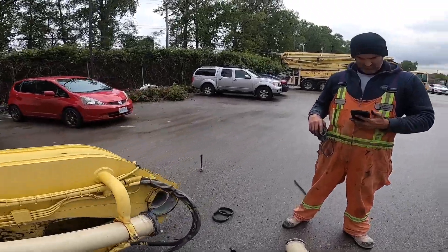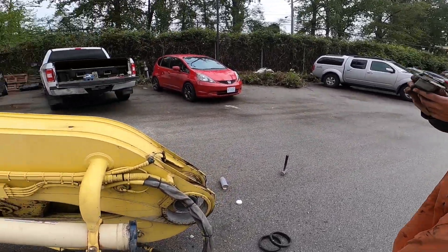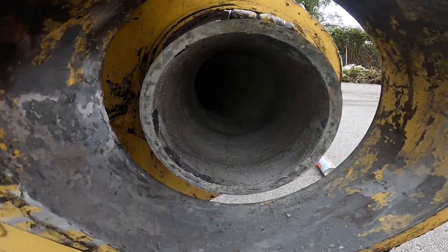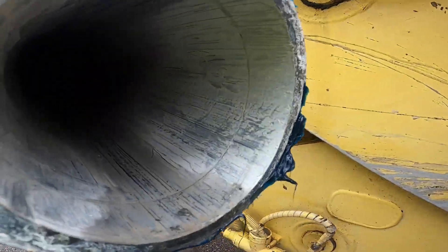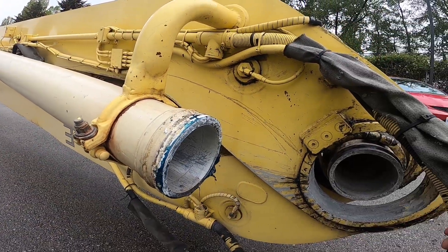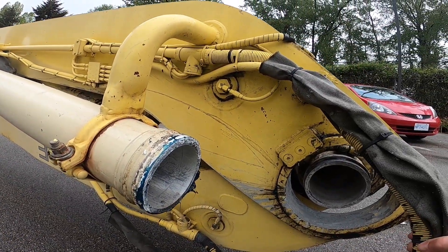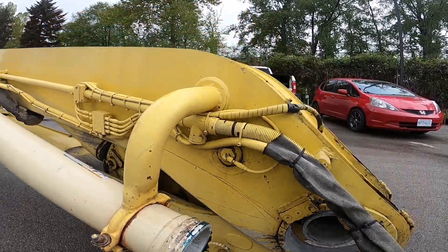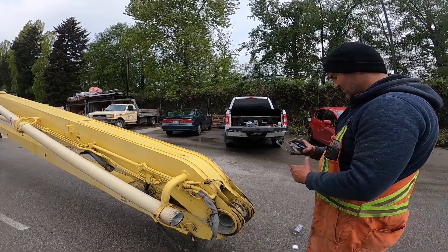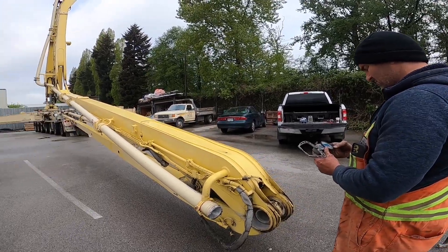What we've got here, Cory's gonna put the caliper on here and we're gonna take a little bit of a measurement. You see these pipes — he sucked back two sponges and they're still a little bit creamy. If you want to get those spotless, use a go-devil. Some guys are gonna say to water-wash — not saying they're right or wrong, we just don't do it in our area for various reasons. Let's get a measurement on this, let's see what this pipe is at.